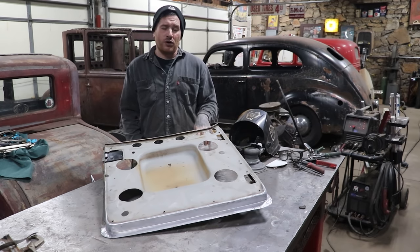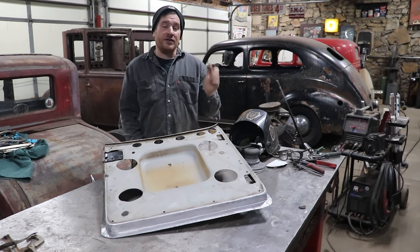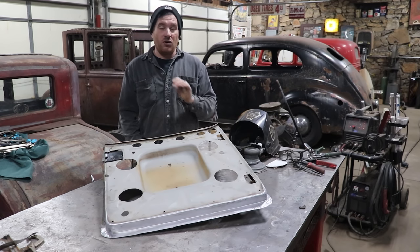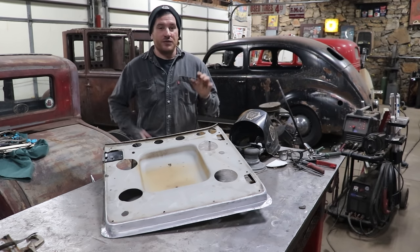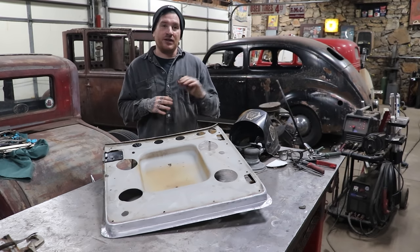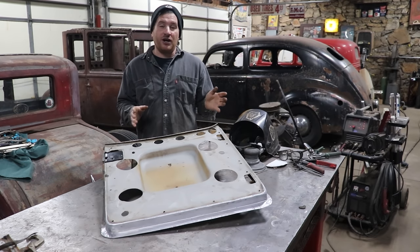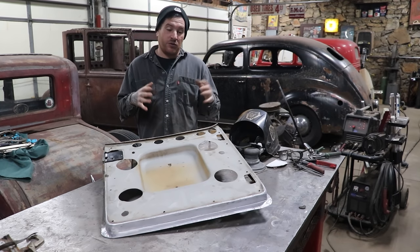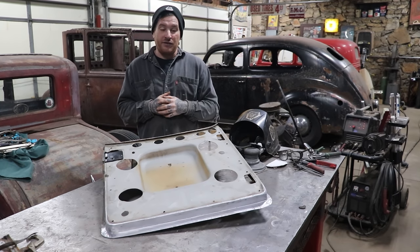Next video, what we're gonna work on doing is just getting the skin hung, and I'm gonna show you guys how these aftermarket door skins on cars that are this old, pretty much all the time, you're going to need to cheat something, whether the door skin needs to be moved just a little bit, or you need to pie cut something, because these cars are nearing 100 years old and you're dealing with aftermarket parts, a lot of times you have to modify the stuff.